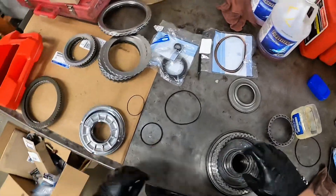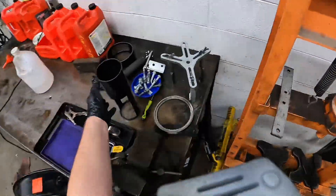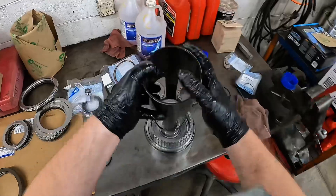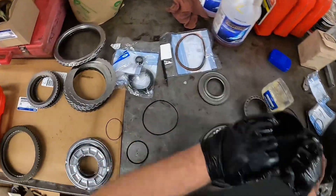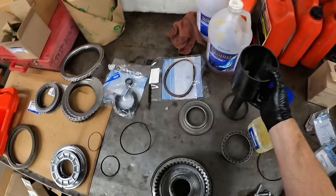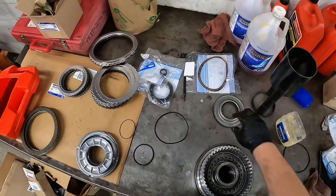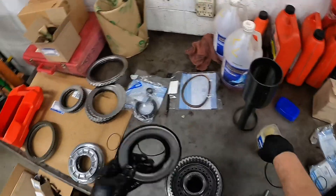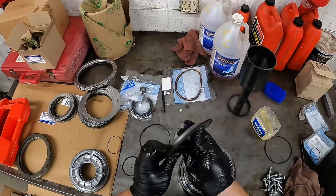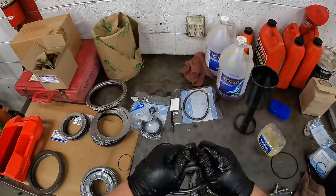Now if you're committed you can push down on that by itself. I like using a press tool because you can get dead center on it — you can feel it, either walk it or just press it down and it goes in straight. Spring lip seal. Since it is a seal, be very liberal with lube because this will roll.